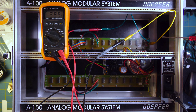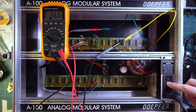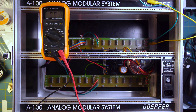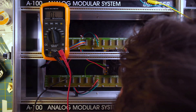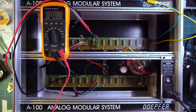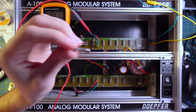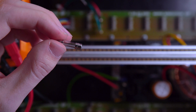I've got my multimeter hooked up to the positive 12 volt rail and I'm going to go ahead and adjust it. It was at this point that I realized something was probably wrong. I changed the outlet I was plugging into, tried some other stuff, checked connections, but none of that was the issue — until I realized there's a fuse in the power input of the case. When I checked it, I found a blown fuse.